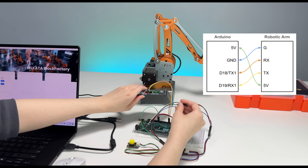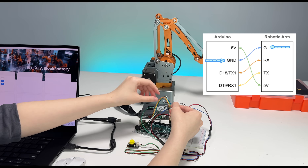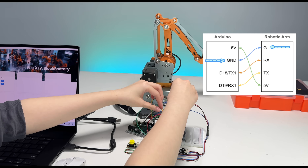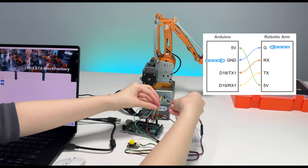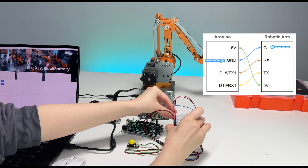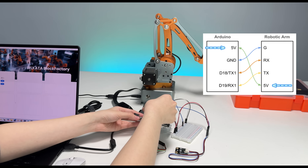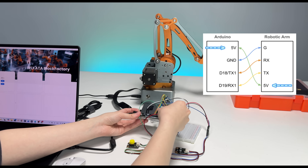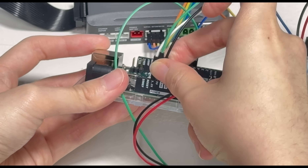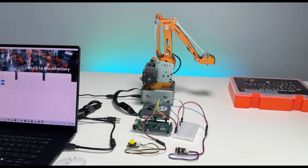Next, we'll have ground, which is the blue wire. We can use the ground on the board. And for green, it's 5V. We need to find the 5V from the board, which is in between ground and 3.3V. That's all for the hardware connection.